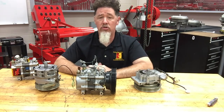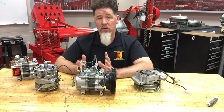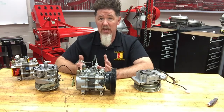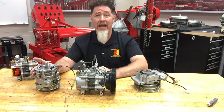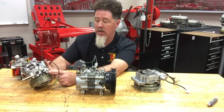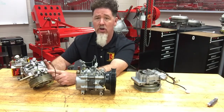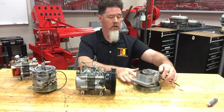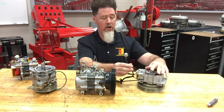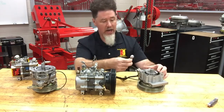Once the pressure gets down to a satisfactory level — around 250 to 300 psi — it's self-sealing and will seal back up again, so you won't lose all your refrigerant. When a car comes in with a low refrigerant charge, you might think there's a leak, but it could be inadequate cooling of the condenser — the fans not kicking on — causing pressure to spike high and triggering that blow-off valve.